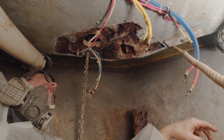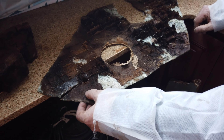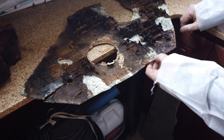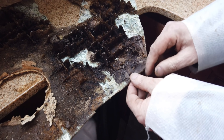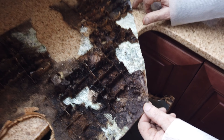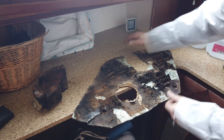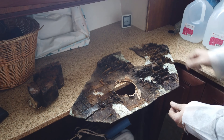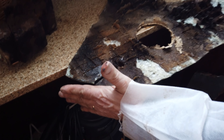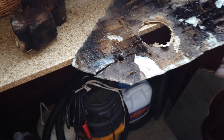You can see where the good core was by the fact that none of it stuck — it's fiberglass here. I pretty much nailed it along this edge as far as being in deep enough. Right here in the corner there's a little bit of mush which I'm going to scrape down. Pretty much nailed it along this edge too. This is the outer edge — this would be the bow, the very pulpit bow point. That's all being replaced anyway.